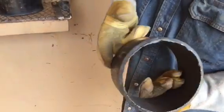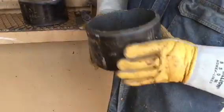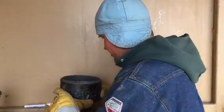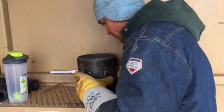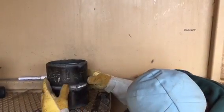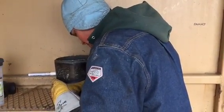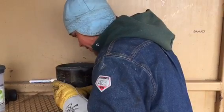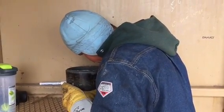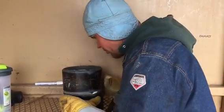On most of these coupons there's a seam, but this one does not have a seam in it. So what you're going to do is get it on here and just kind of rotate it — rotate the top to where the gap is pretty good all the way around it. Always fit the inside. Okay guys, that don't look too bad.